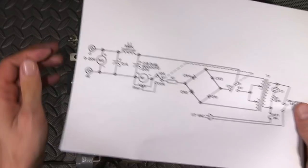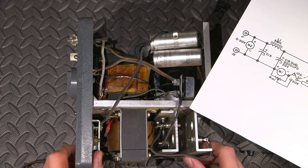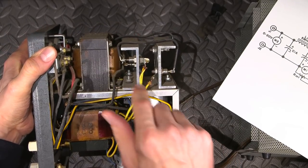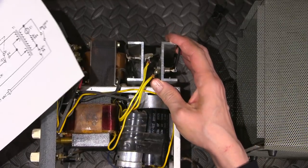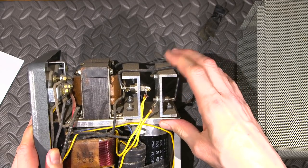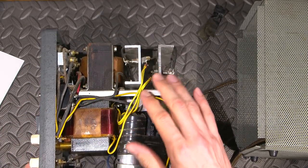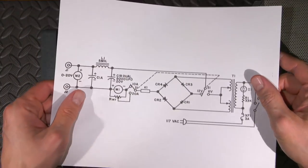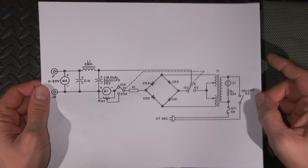We have a 3 amp fuse with a funny-looking holder somebody added, the on/off switch, and the selector switch for 10 and 20 amps. On the other side we have the diodes in the full wave bridge - all separate diodes, not a single square bridge rectifier package - wired up as a nice big high-current bridge. These two diodes are on a heat sink and the other two are on their own heat sink. The bulk of the weight is the choke coil, the variable transformer, and the filter caps. Very simple design.